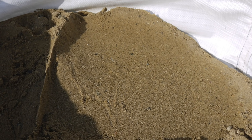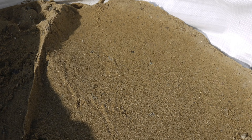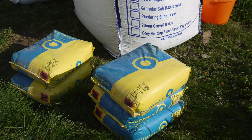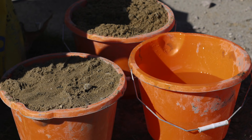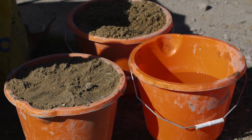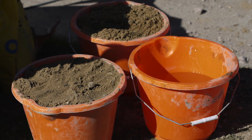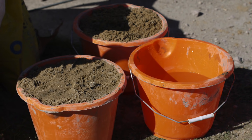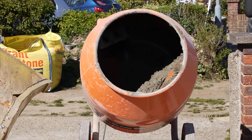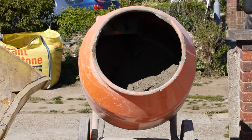The concrete was made from two jumbo bags of ballast — a mixture of sand and stones — and cement, which is best bought in waterproof bags to keep it dry. For each mixer load, use two buckets of ballast, half a bucket of cement (a 4-to-1 mix), and about half a bucket of water. Using plastic buckets as measures makes the job easier to control. Adding the water slowly helps ensure consistency — neither too sloppy nor too dry, as shown in the video.